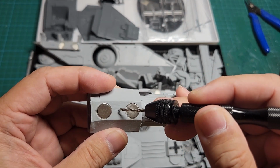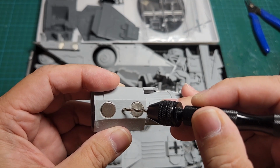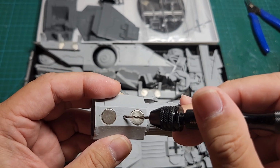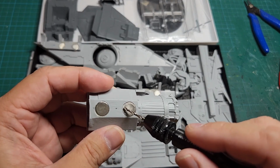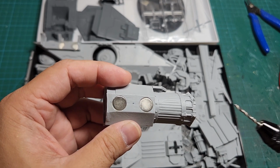If I start to drill, I push this down there. I go, yeah, that's right on the dot. And as I start to turn this to drill, you see how it walks? There's the possibility that the turning motion will make your drill bit skip off the dot, and then you start actually drilling off center. Be careful of that.